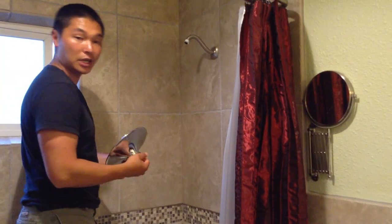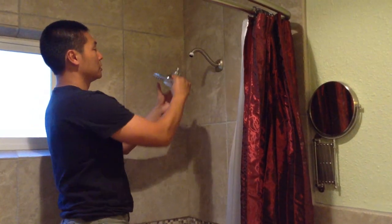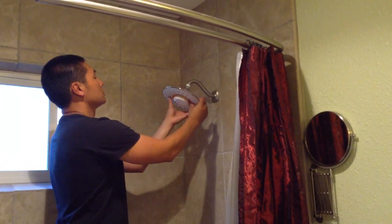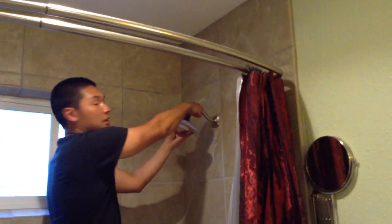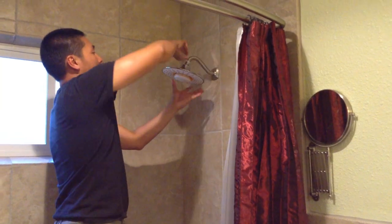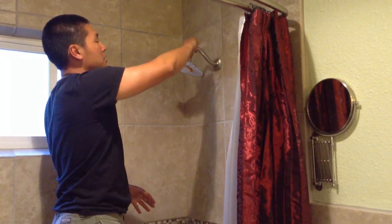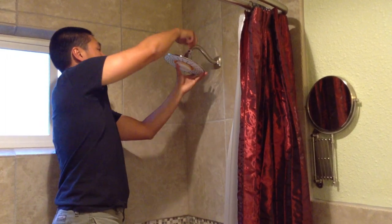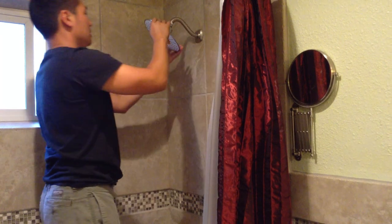This thread sealer is a very thin plastic tape that you wrap around the threads of your existing pipe — about twice around — before screwing on the showerhead. If you don't have it, you can find it at any hardware store like Home Depot, Lowe's, or Osh. If you don't have that, you can even use a piece of a plastic shopping bag wrapped around instead. To install, just place it on and turn clockwise. You don't want to use a wrench — just hand-tighten it so you don't strip any threads. Hand tightening is more than enough to ensure there are no water leaks, as long as you've applied the thread sealer tape.